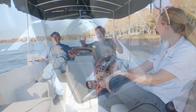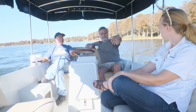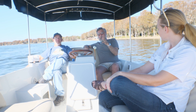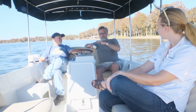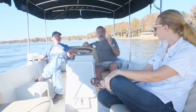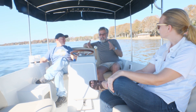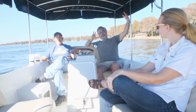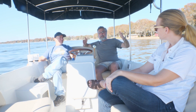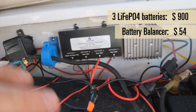What we've done: the prime mover — the electric motor that drives this — is a 36-volt inboard electric motor, a big beefy thing with variable speed, just like you'd expect from a diesel. But all the controls, bilge pumps, lights, radio, and accessories are 12-volt, so the thing won't work without 12-volt but it needs 36 as well. So we put in a buck converter that takes 36 volts and brings it down to 12 volts, so everything 12-volt has all the power it needs and the batteries are used uniformly. We also put in a device that looks at each battery and has the power to rob from one and put into another, keeping the batteries balanced since they're in series.